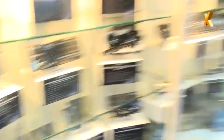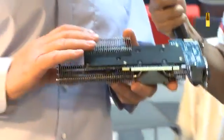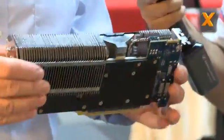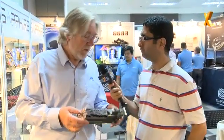Looking a bit further down, you've got a 7770 Ultimate — a really wide heat sink, probably about as good as you can get in terms of a passive card. It's a brand new card with a specially designed PCB. We put all the memory on the reverse side of the card with a heat spreader, which allows the main heat sink to take away all the heat from the GPU and other active components. It's a very compact solution and not too heavy because the heat sink is aluminium construction. It's dual slot — the heat sink is pretty wide, but our product manager thinks we might be able to trim it down slightly and still keep temperatures within good limits.